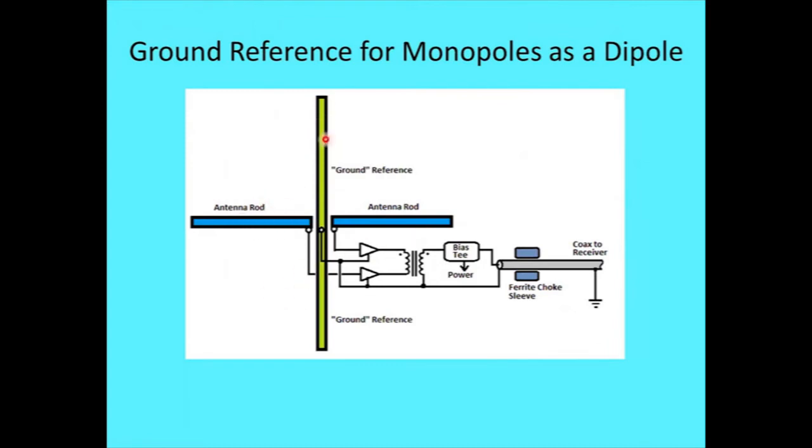However, one thing I noticed before I put this rod here, when it just had this grounded at this point, with no rod, is that I turned up very strong HF signals, because I was running into an SDR so I could see the 15 meter ham band. And before the sun was even up, I was seeing 15 meter signals booming in there. A good part of the reason for that is the vertically polarized component of this is good at a low angle.